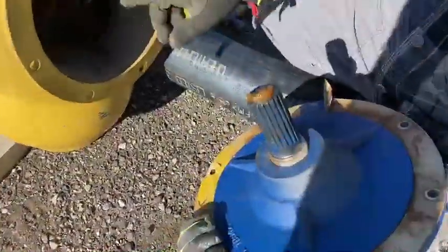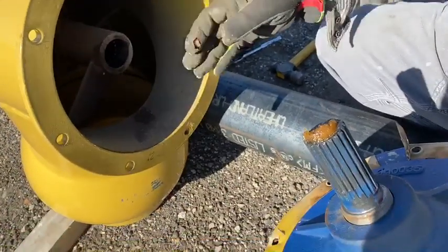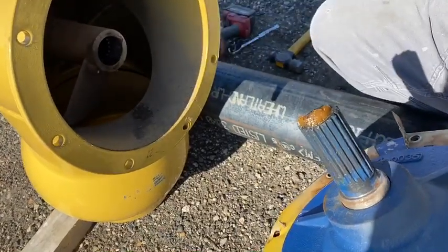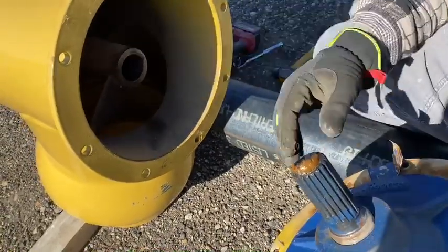It's splined, and the spline slides right inside the shaft. Now, this auger is not on a plant, it's just in our yard. If the auger was at an angle or incline, you'd want to open a bottom hatch on the tube and support the flighting.